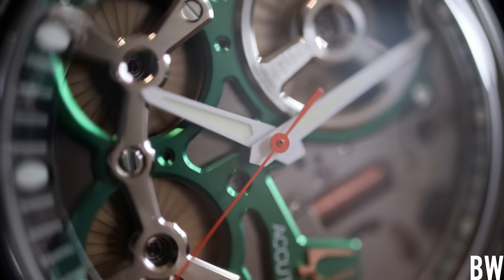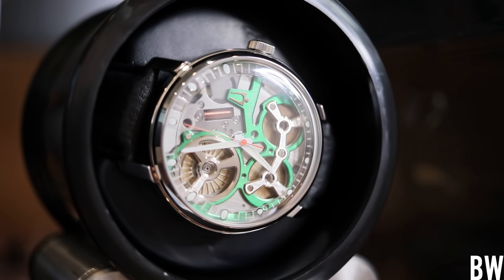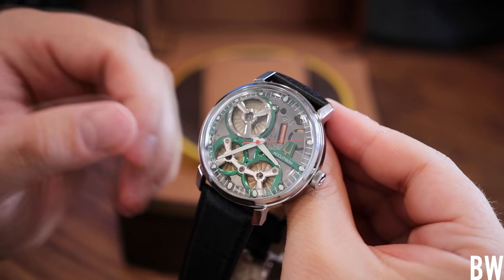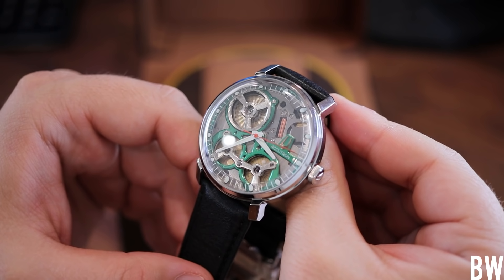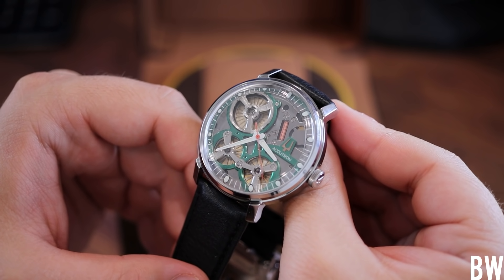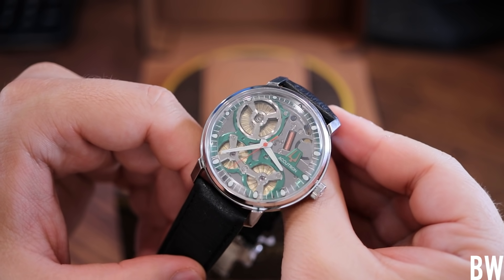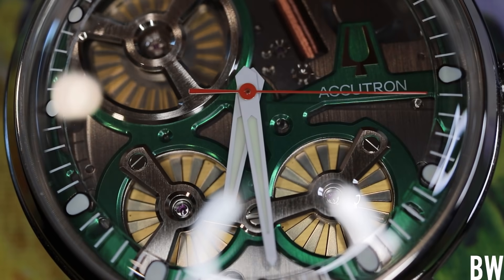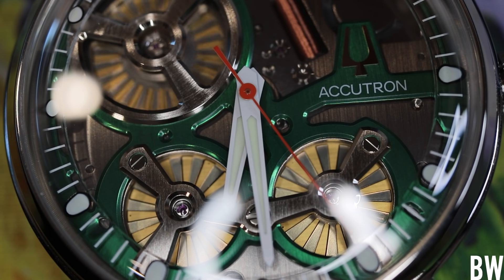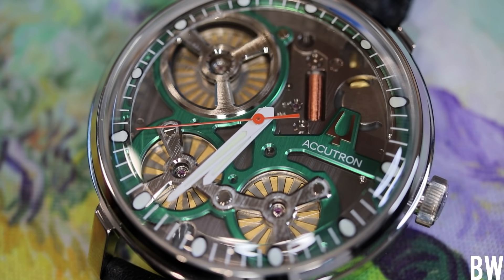The movement accuracy is not the draw here. The smooth second sweep is one of the draws, and the power saving mode is another. But the biggest draw is the fact that the movement utilizes twin turbines, which you can see here on the dial, that spin with just normal motion as you wear this watch going about your day-to-day activities. The turbines are connected to electrodes that generate static electricity, which is then stored and used by a pair of motors. One motor is a standard electrostatic motor that powers the running seconds hand — that lovely smooth sweep. The other is a traditional step motor that powers the hour and minute hands. All timekeeping is synchronized through one quartz circuit, visible expansively through this bubble sapphire crystal.